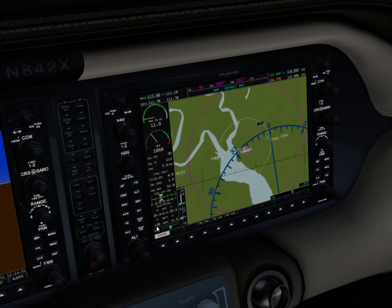Below 9 volts, it starts shutting down the PFD and MFD. And at 8 volts you can't power anything pretty much. So if it gets lower, you need to shed some buses. But this is quite okay. Above 24 volts is 26.4 on both alternators. It's not a problem.